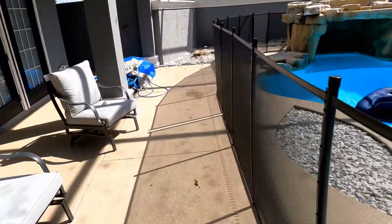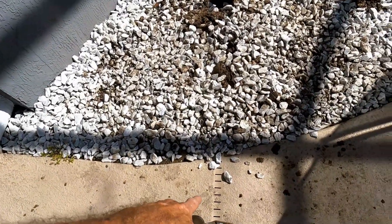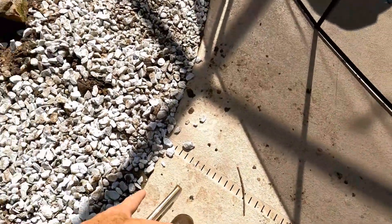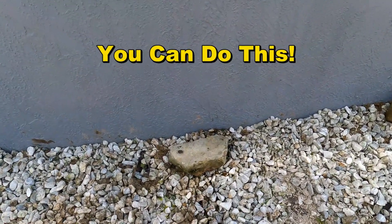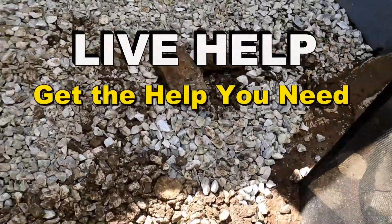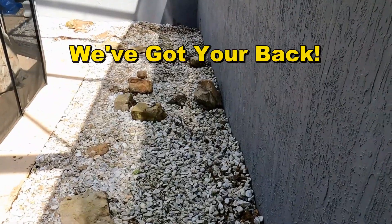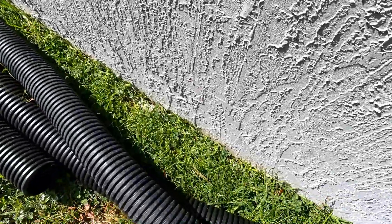Okay, so we finished the channel drain. Basically, we put that three inch pipe butting up against the end of the channel drain with gravel around that area. As water comes down through the channel it just goes through the gravel into that pipe and discharges out that six inch hole. We also found another core that was obsolete — we used that, brought this section of the channel drain over here, brought it down with 90s, and by that rock we turned it with a T so it drains out through the wall as well. Here's the pool discharge — you can see it comes out quite well, and that other discharge is actually underground somewhere right over here.